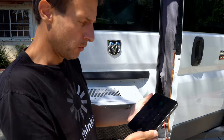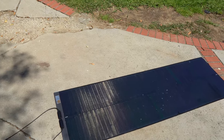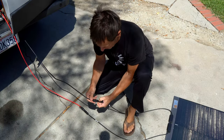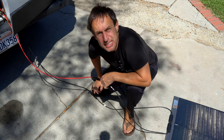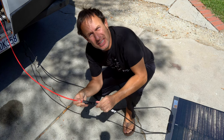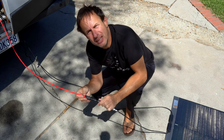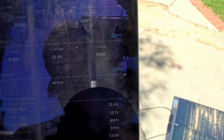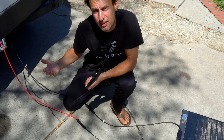It's 11:30 out in full sun. I'm a little worried that I've done some damage to the panel. The negative one is really easy to unclip — pinch this and it comes out. If you're just testing, don't clip it all the way in — almost in, it'll make contact so you can test it. Wait until you're permanently installing it before you do the full click. They're not fully clicked in — 125 watts. Panels rarely put out their full output. Certain times of the year you can hook up way more panels than you thought you could into the equipment you already had. Get more panels than you think.